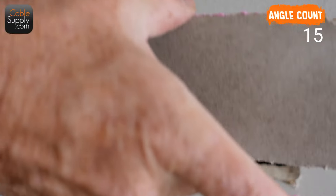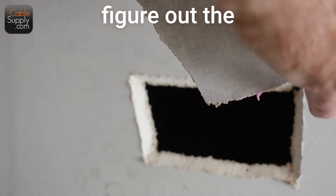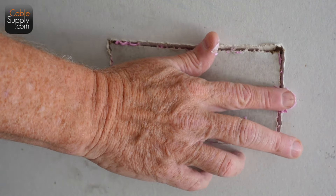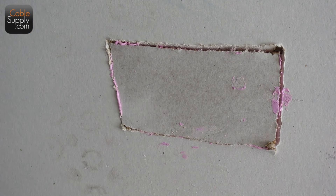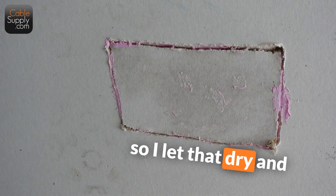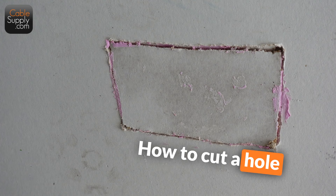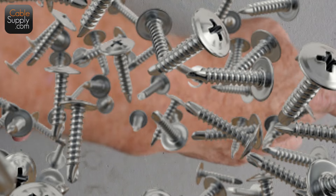The reason I never cut it completely square is because it's easy to figure out the angles to put it back in. So I just push it in there. I let that dry and then once it dries, I come back and touch it up with the spackle. And that's basically it. How to cut a hole in the drywall in such a way you don't have to put wood behind it with screws out to the side.